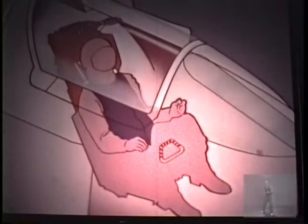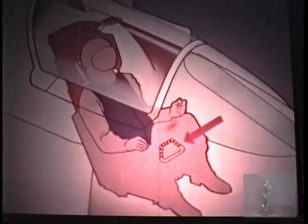Pre-ejection begins when the air crewman grasps the primary control handle and pulls the face curtain over his head. If, for some reason, he can't reach the face curtain handle, the ejection sequence may also be initiated by pulling the secondary control handle between his legs. Pulling either handle will jettison the canopy, reel the man in and lock him against the seat, and detonate the catapult gun. This begins the ejection phase.